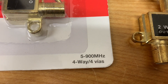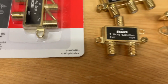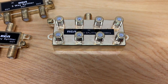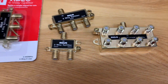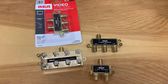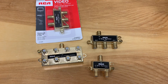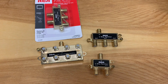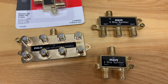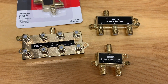Splitters made for TV antenna systems have a narrower bandwidth than digital cable or satellite splitters, and you can split two, three, four ways — even this one here that splits up to eight ways. But the more you split the signal, the more problems can arise. Splitting an antenna signal is sort of like pizza at a party: the more people you invite, the less pizza you get. The more TVs you add, the weaker the signal is at each TV.